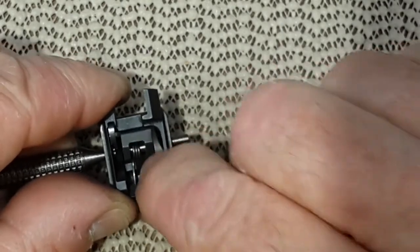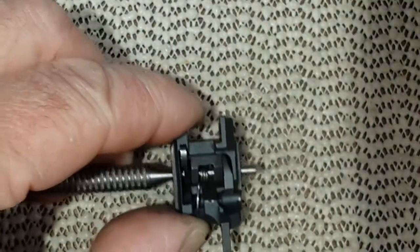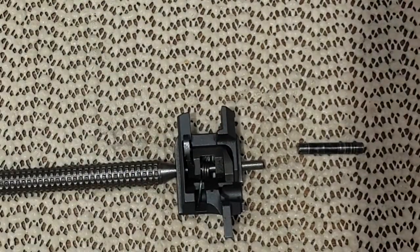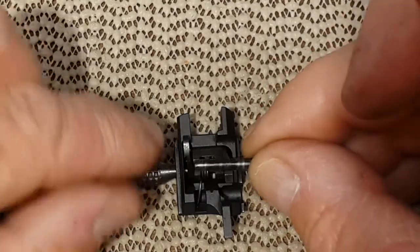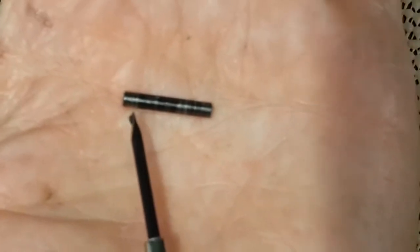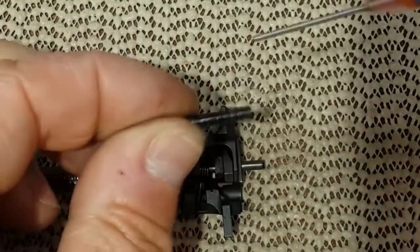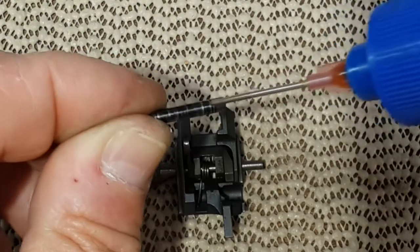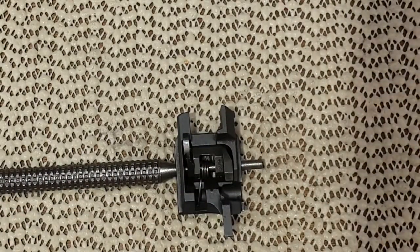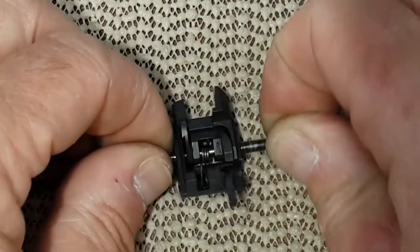I can see that part moving and coming back. I can see this one moving and coming back. So everything is in working order. Now all you have to do is put your punch through. I'm going to put a little bit of oil through that pin because the pin has some wear marks right here and there all along. That's where you have metal-to-metal contact, and that is where I'm going to put a little bit of oil — just at the tip — and as I push it in, removing the excess, it's going to lubricate every metal-to-metal contact.